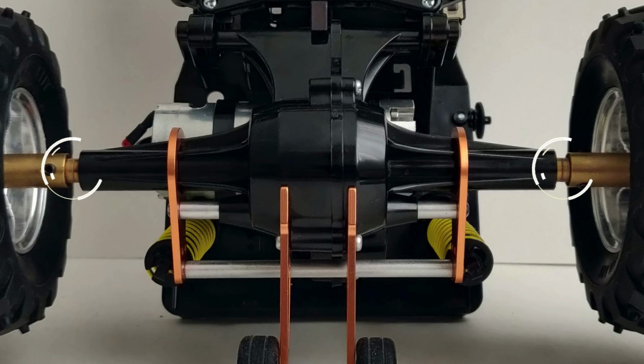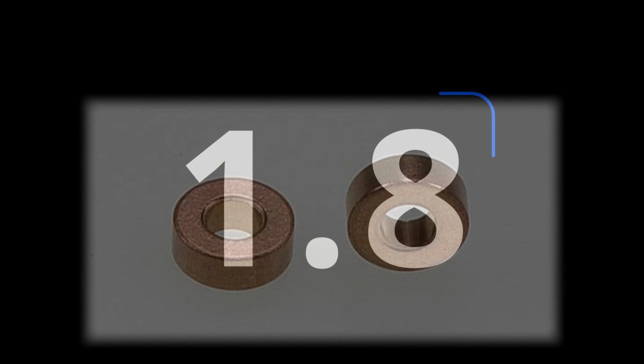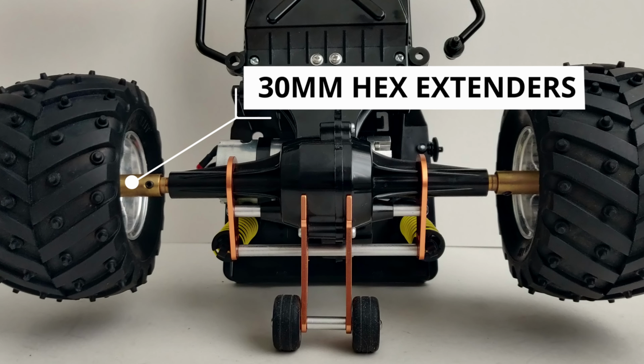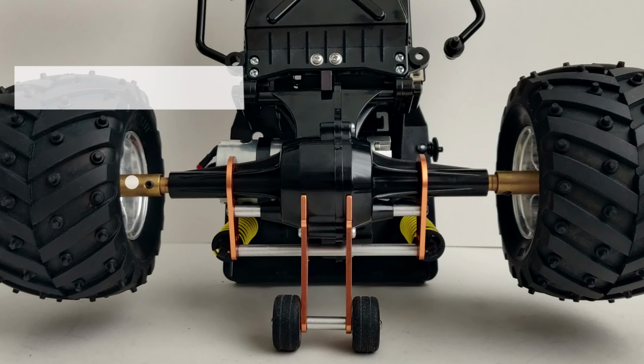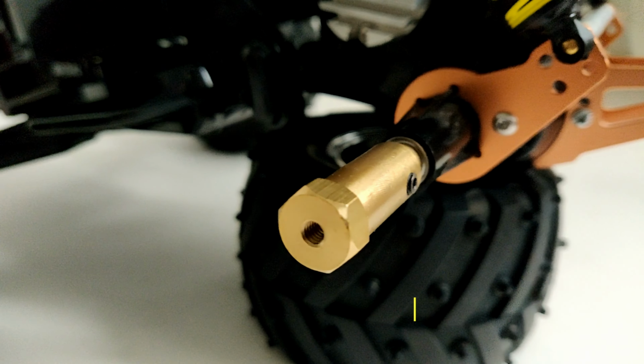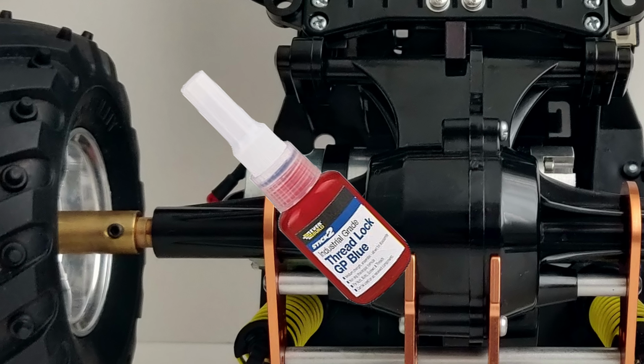1.7. To act as spacers before installing the hex extenders, I used 4 Tamiya metal bushings. And that brings us to 1.8. These 30mm hex extenders are actually sold as robot fittings, and I bought these from AliExpress. Link in the description. I flattened a part of the axle using a file, as you need to tighten them down using a grub screw, and I added some blue thread lock to avoid them coming loose.